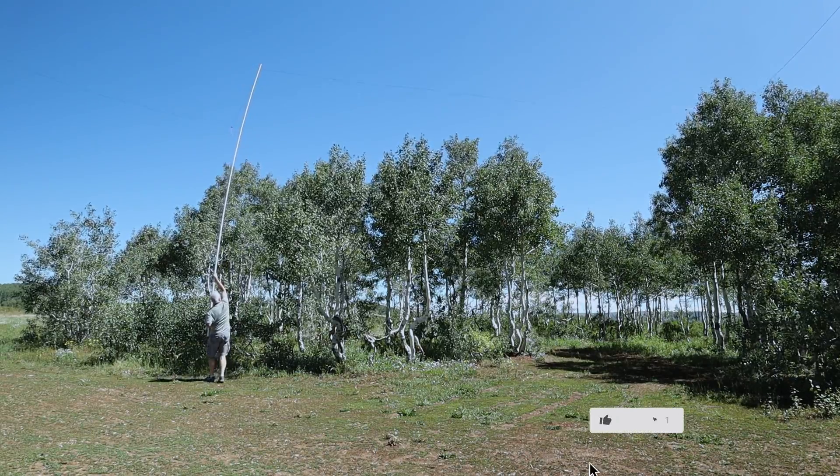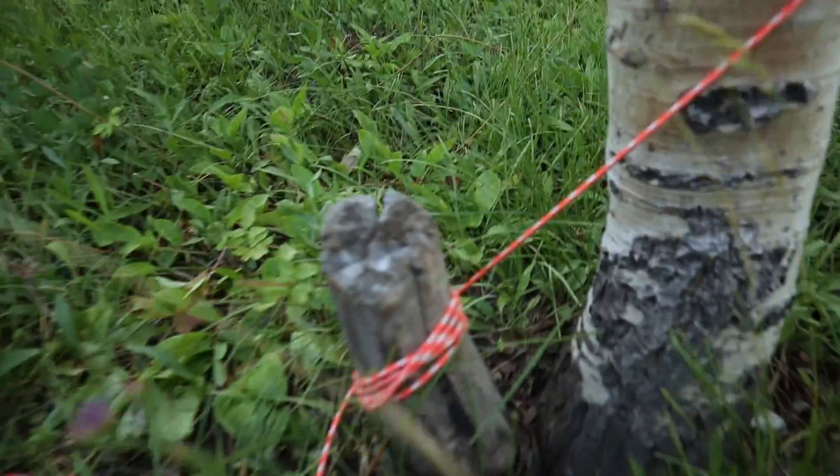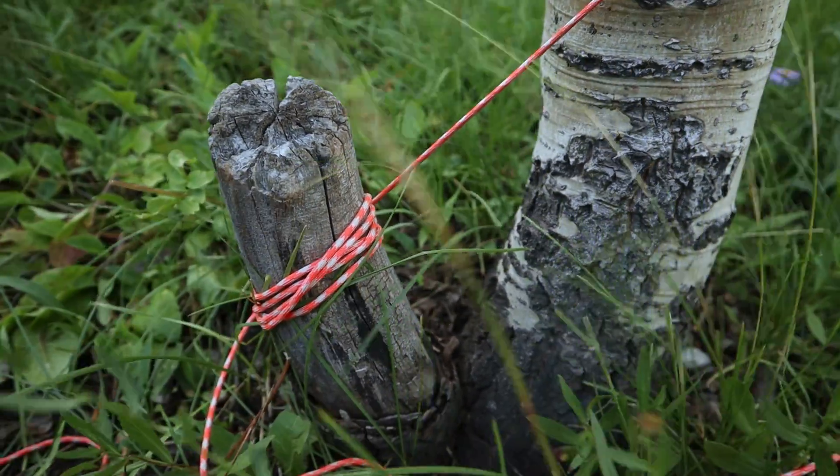My feed point is going to be on the end of the camper at the top of the mast. Pro tip: when putting wire up into a tree, start with your wire out in the open, and as you raise it use a stick or long device to pull the wire up and over the trees so it doesn't get stuck. The throw line goes up over the tree and comes down where it's tied off to the ground. For tying down your rope once your antenna is up, it doesn't have to be complicated — just wrap the excess rope around a tree trunk, stump, or branch. If you wrap it around itself and make a bunch of loops, that's going to hold the antenna fantastically.